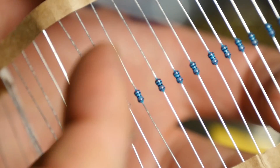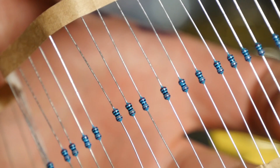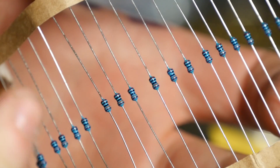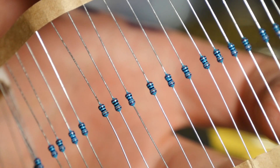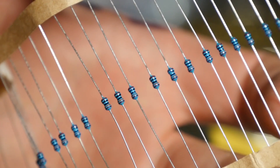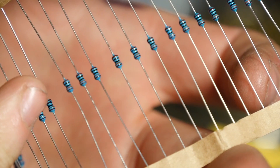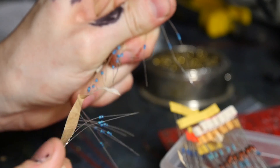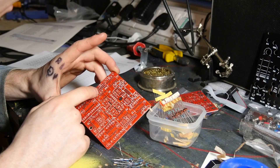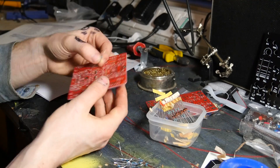The rest of it is a piece of cake. Every single resistor has colored bands on it that mean different things, and luckily the instructions tell you what these bands mean. I'm looking for 100k resistors, which means you need brown-black-black-orange-brown. These must be the 100k resistors — tear them all off and find the color numbers that fit.